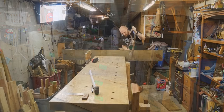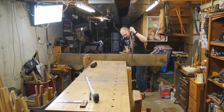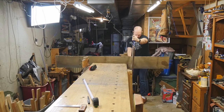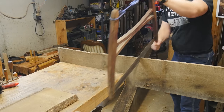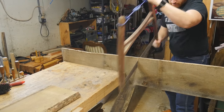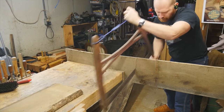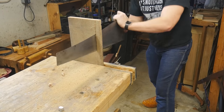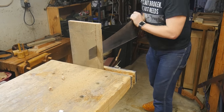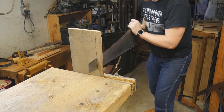All of the sides, front and back, are made out of solid white oak, four-quarter to five-quarter thick. I love using this bow saw to do the rough cutting — the cross cutting is fantastic with it. It's great for green wood, but when I just want to make a really quick, massive cut, it's the saw I use. Then I need to rip it all down to length, edge it to the width, and get them ready for the sides and back.